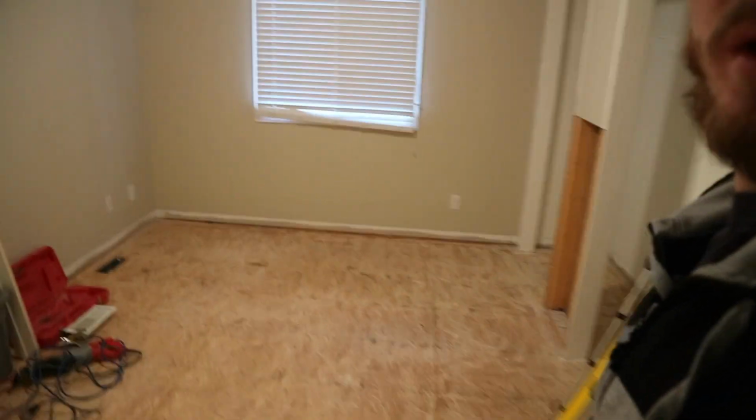But, so I'm picking up the flooring this week, and it's gotta sit in the house for 10 to 15 days before it can kind of cure to the temperature in the house so that we can get ready to start installing it. But got all the flooring up, all the staples pulled out from the underlay of the carpet, all the tack edge up.